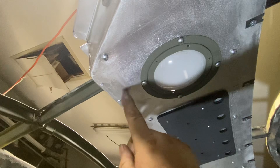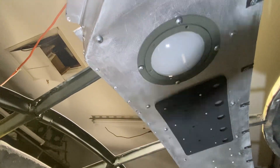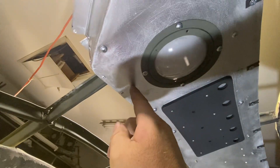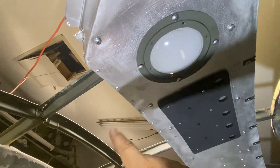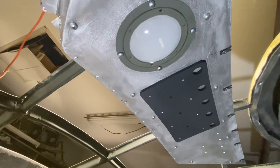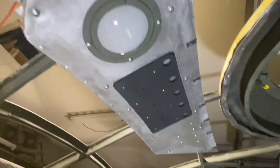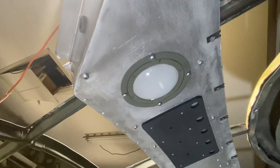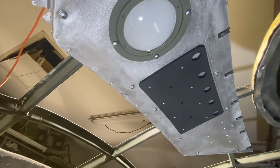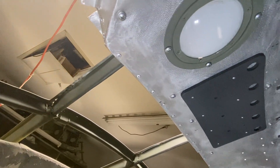I need the two-way switch for red and white. I can find the switch — I can find the exact AN number switch — but what I can't find anywhere is the little switch guard. It's a little pressed piece; there are three of these on the flight deck and I need three of them. They're made by Cutler Hammer, they're pretty old, and I can't find them. But if push comes to shove, I'll just make a little die and press them, because they're pretty simple — a very simple pressing and a Dremel tool would probably solve that problem.